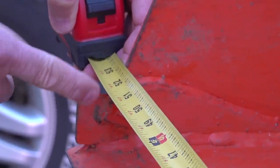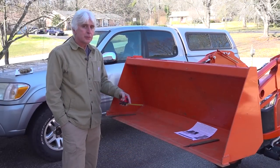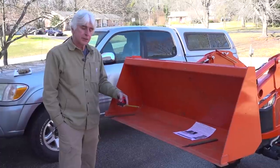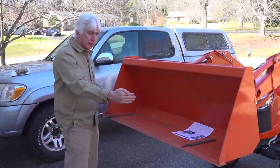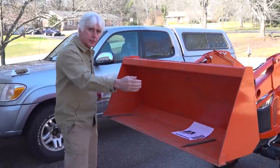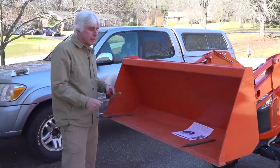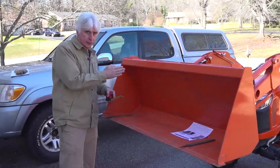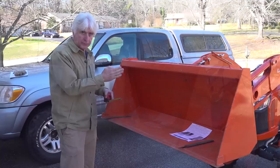You would want to drop back to 52 inches — that's the nearest quarter-inch measurement. So I would order a Piranha Tooth Bar based on 52 inches. Even though I've got 52 and 1/8, they want the closest quarter inch, and I can't go over because it wouldn't fit. So I have to go the closest quarter inch less than the actual measurement. 52 and 1/8 is 1/8 of an inch over 52, so I go to the closest quarter-inch measurement, which is 52.